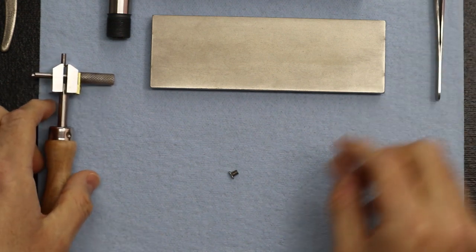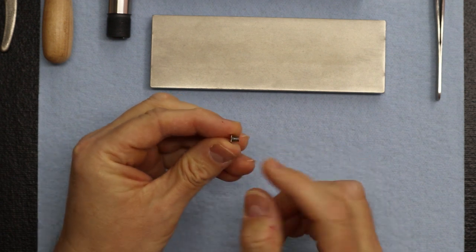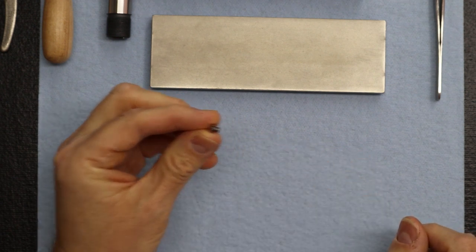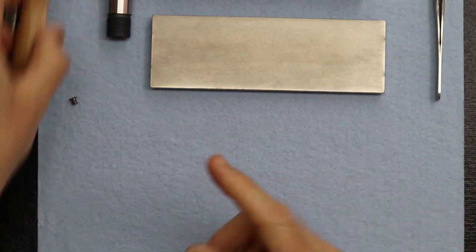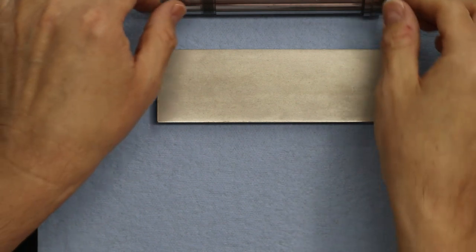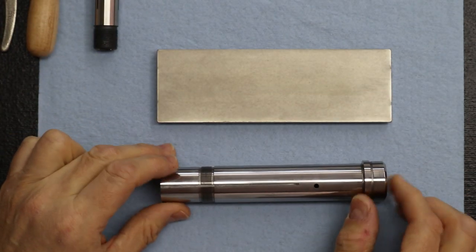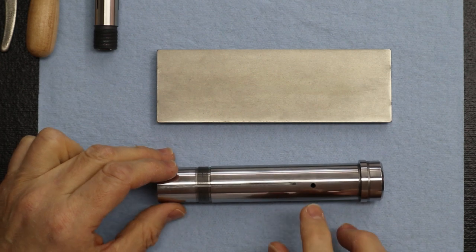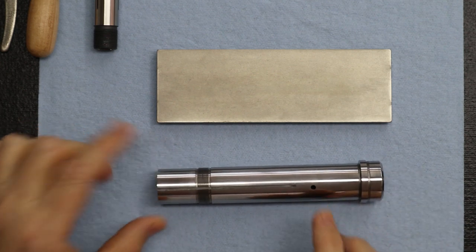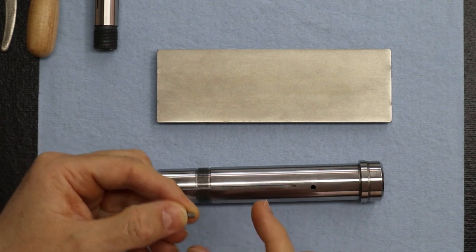Measuring. Let me tell you how I measure. Obviously, if you have the old key, you can take your measurements off the old key. So that's what I did, and then I was able to scribe where I need to cut off. This is how we measure the wall thickness of the spindle, if you disassemble the spindle and there was no key at all. So we need to take measurements so you know how much material to take off on a new key.